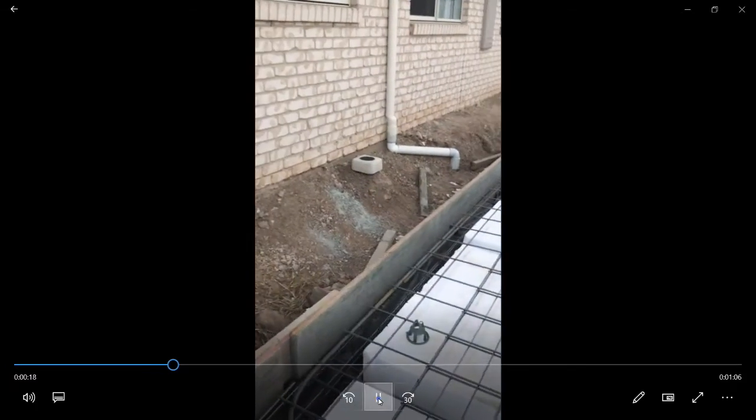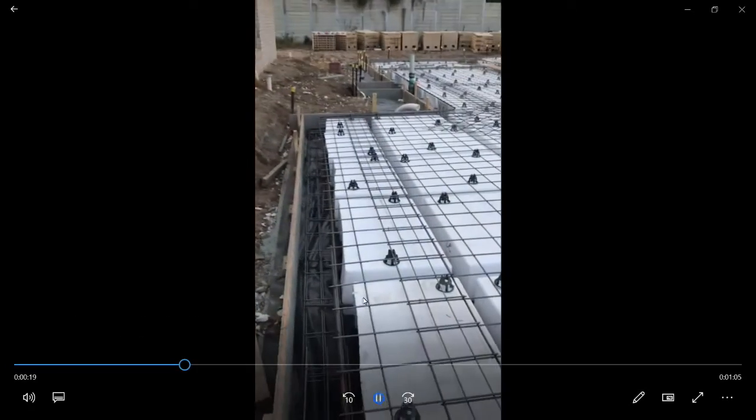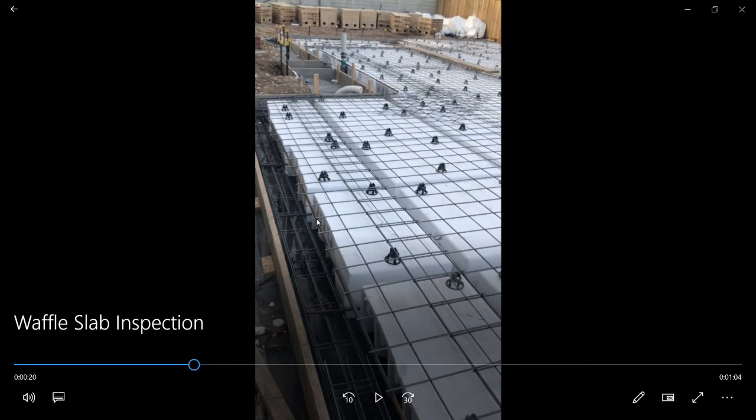Coming up to the left-hand side, we get a good close look at what's in the bottom around the outside edge. There are three bars — one, two, three — plus the extra bar up on top hanging off the slab mesh. These three bars in the bottom are the bottom reinforcement in a waffle slab design, and the slab mesh is the top reinforcement. This is the strength in one direction when the load is bearing downward, and this is the strength when there's uplift load — or hogging, as we call it — when part of the slab is cantilevering.